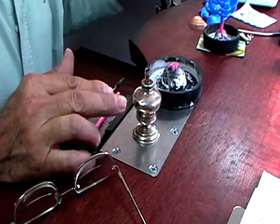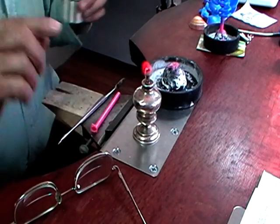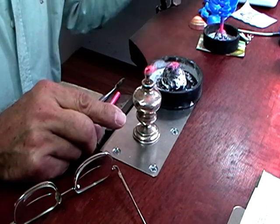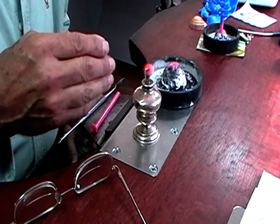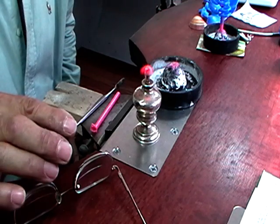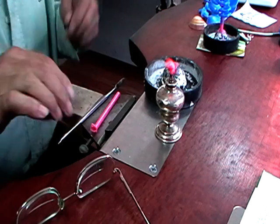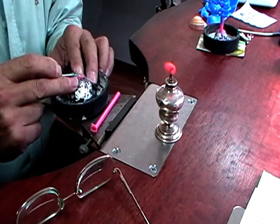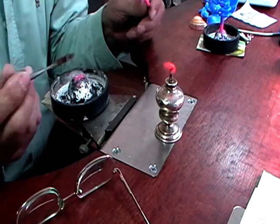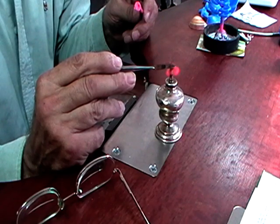When you're working with an alcohol flame, be very careful, because it's usually not very visible. Oftentimes it'll burn clear, and if you put this someplace where you can knock it over, it will catch your whole bench on fire quite easily. So I always put mine somewhere where I'm not working. I'll be working here, and with the flame here I won't have a chance of bumping it so that it knocks it over. So I just use this to heat my wax working tool.